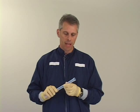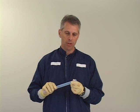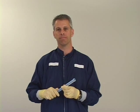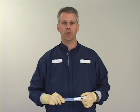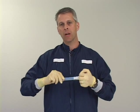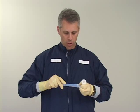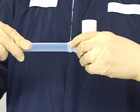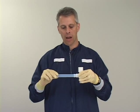Overheating is a result of keeping the tube over the heat source much longer than the recommended time. If this happens, the tube will collapse or buckle as it's inserted over the mandrel — that tube will need to be cut off and re-flared. Follow the recommended times in the table. Short flares are the result of the tubing not going all the way into the mandrel and up to the tube stop. The result is that the tube gap — normally 80 to 150 thousandths — will be much larger, creating the potential for the fitting to fail, with the tube blowing off or extruding out of the end of the nut.